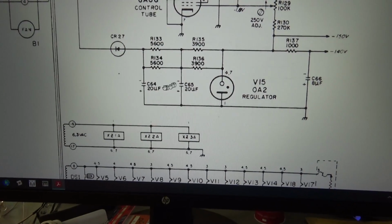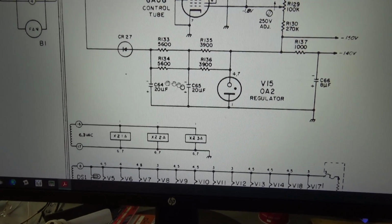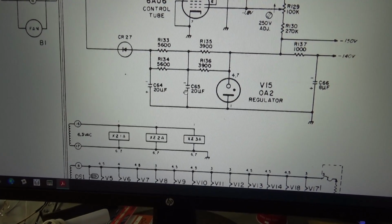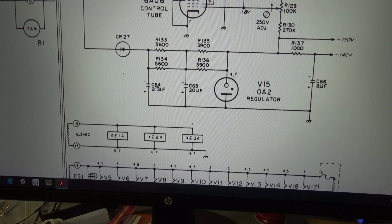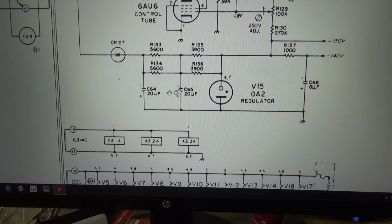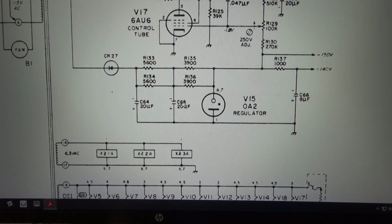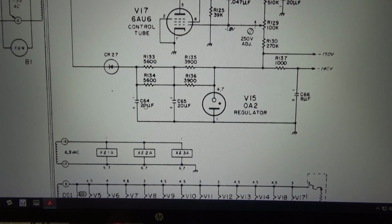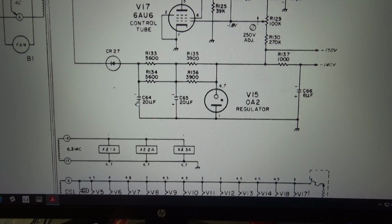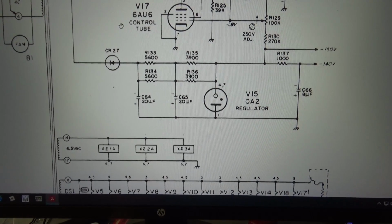I'm about to pull them loose and check them. And if they're bad, I'm going to go ahead and get some replacements for it. And I probably won't stuff these two. I'll probably just use discrete components right here. But that's the next phase in the project, is me checking these two capacitors. Because one of them is definitely super leaky. And anytime you got leakage like that, it's a resistance instead of a capacitance. And it does load the circuit.